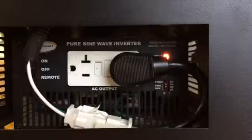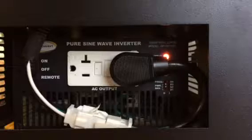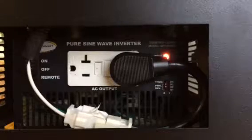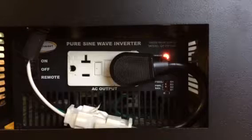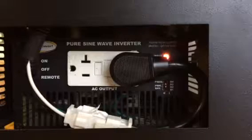How to Reset the GFCI Outlet on your Idle Free Inverter. First, confirm the GFCI is tripped. If the light in the lower right hand corner of the white plastic outlet is dark or off with the inverter on, the GFCI is tripped.